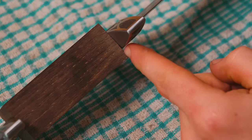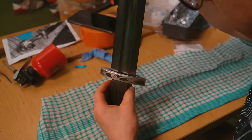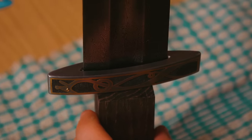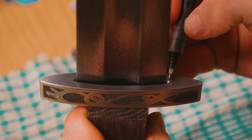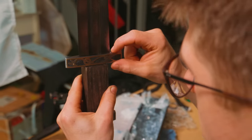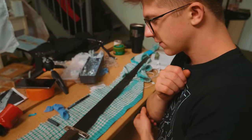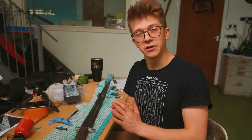We have a slight issue, which I think we can resolve with how we sand the end of our bog oak handle — a slight little bit of air on one side where the tang sits in the wood, so we're going to have to sand the bog oak more on that edge. But sadly, there's one thing I've just noticed: when I look down here, the blade sits nice and centered in our groove, but in this direction I did not check to make sure the distance from the edge of the sword to the edge of our chamfer was the same. You're going to see about an eighth of an inch here and about three sixteenths over there. That's a problem. So regrettably, I've got to fix that after this is all painted and the inlay is looking beautiful. I need to be really careful not to scratch what is already finished — it's going to be difficult, back in the microscope and with the pendant drill to hopefully get that all sorted.